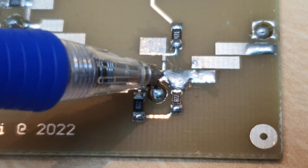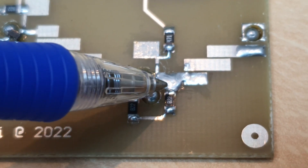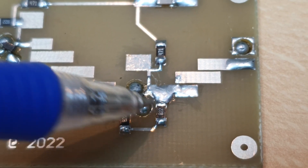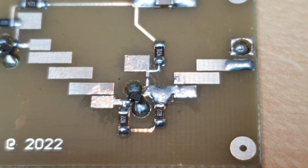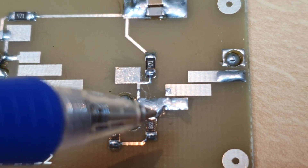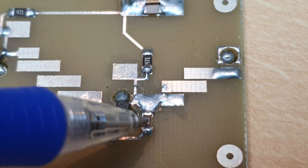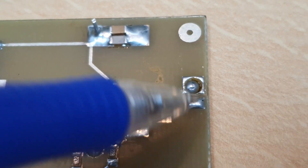Here I made an error in the design — I forgot that I was creating a stub in the base bias connection of the transistor. The stub was resonating exactly at 10 gigahertz, killing almost all the signal at the output. So I needed to place a copper tape and this blob of solder here to make an overall connection without the stub action. Now we have full power at the output.